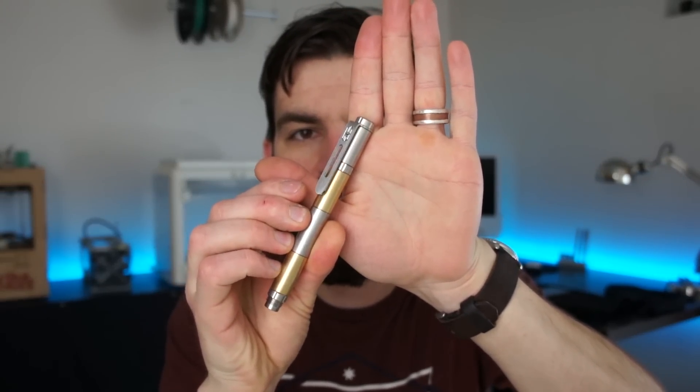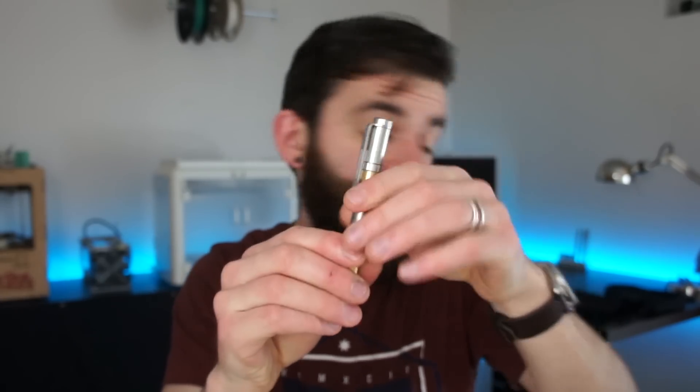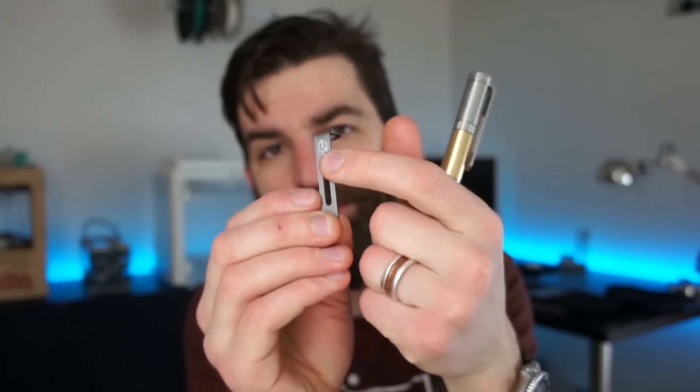This is the clip basically right off the mill — it's just mill finish with slightly sharp edges because it was milled without any corner chamfer. With my jig I can't get my chamfering tool in there, but I quite like it, I just want the stone wash finish. I took another clip and popped it in the tumbler for about four hours and all it did was basically matte that finish out, gave me a nice stone wash look, didn't rub out the engraving, and just took any of the sharp edges off so it has a much nicer feel and slides into your pocket a lot easier. I didn't have to do any hand finishing — that's the main reason I bought the tumblers. I can cut all these parts, pop them in the tumbler, let it go, pull the parts out, clean them, and it's done.